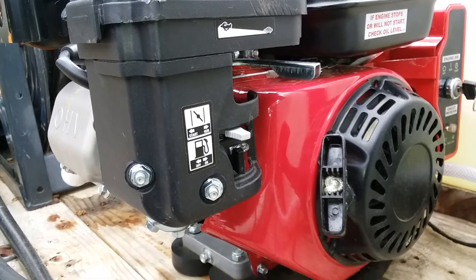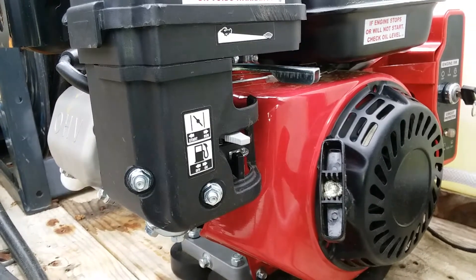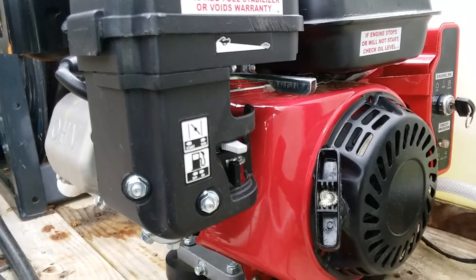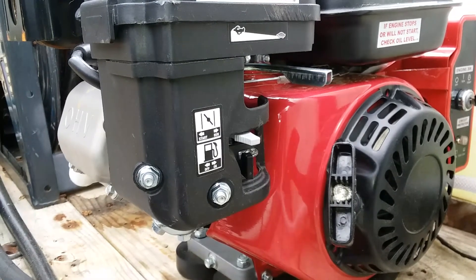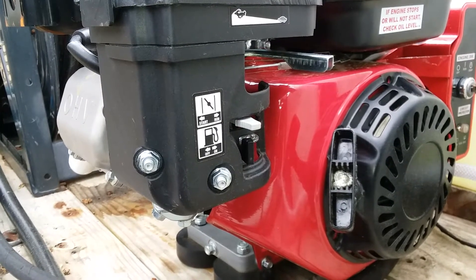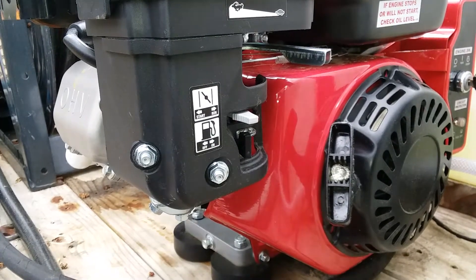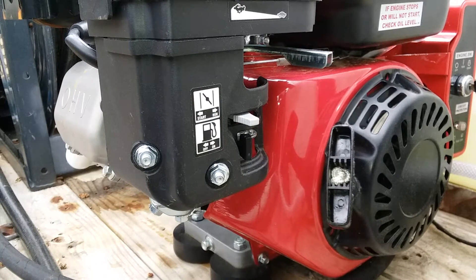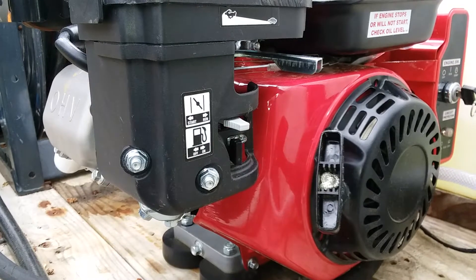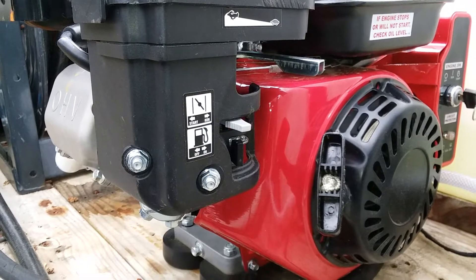If you don't plan on building this, it's pretty easy. The engine was $99 and the pump I got was the cheapest they had off eBay — only 2.3 gallons per minute, around 2,500 PSI. The listing may say 3,000 but trust me, it's 2,500 PSI at start, and when it's running spraying water you're down to about 1,400 to 1,500 PSI. In my world, that's around the sweet spot.